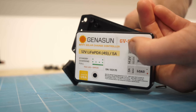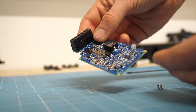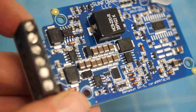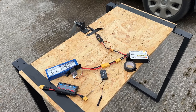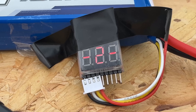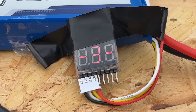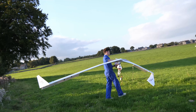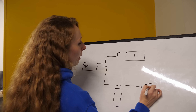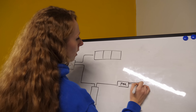Because we hadn't done any proper bench testing before our first flight, we had no idea that this feature even existed. As the battery steadily discharged, with the sun levels being quite low by the time of the crash, the MPPT decided to shut off, causing the plane to shut down mid-air and fall out of the sky. So the big question was, could we design a simpler system without this point of failure?